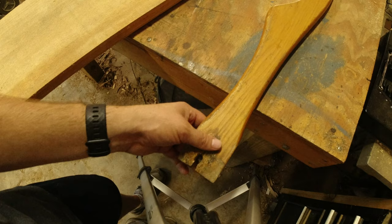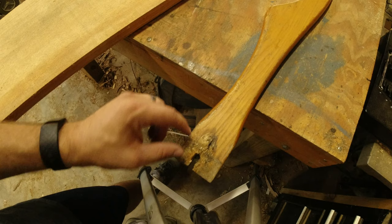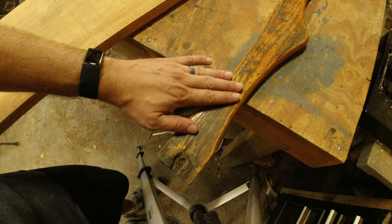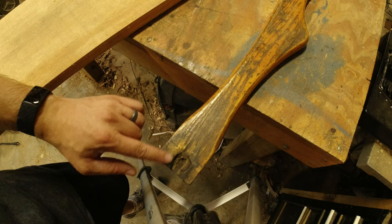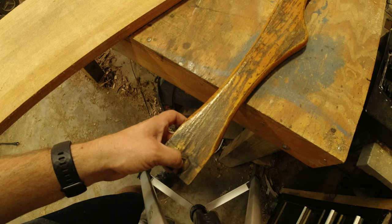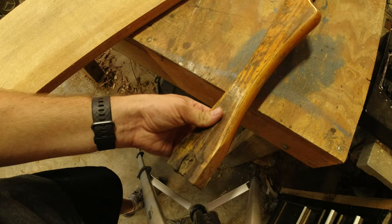I've got this off the canoe — just took the bolt out of the other side. Here's a close-up of the side that broke. You can see it kind of punched out of the end of the wood. The underside shows some rot — looks like water would sit under there and not dry off well. Maybe the finish wasn't done well underneath either. I think it came loose first, and when I went to pick it up it started punching out and broke the block out of the side. But the wood actually looks pretty decent further in — still, it's time to get a new one.